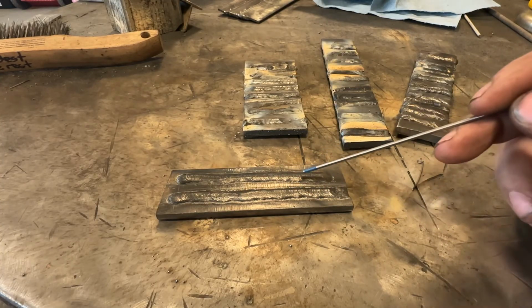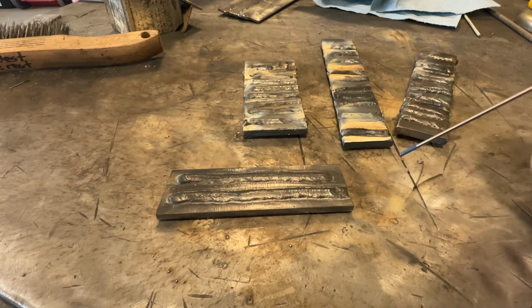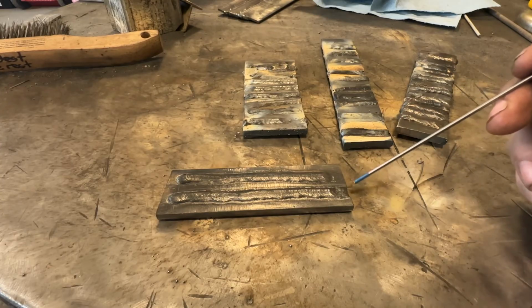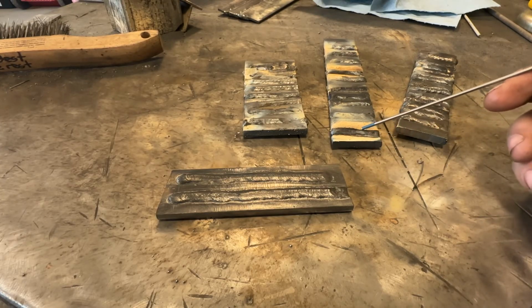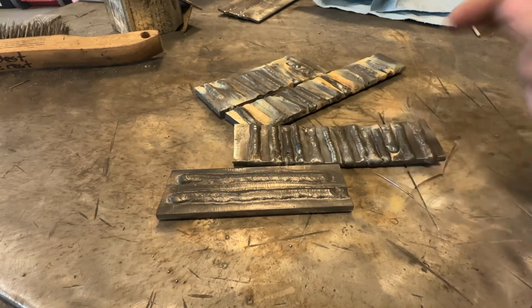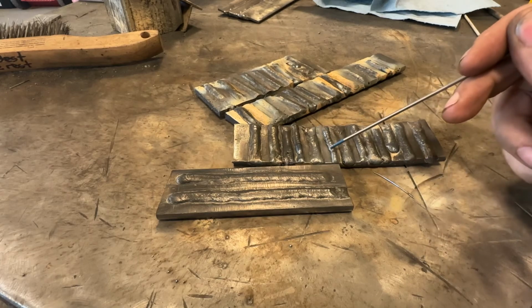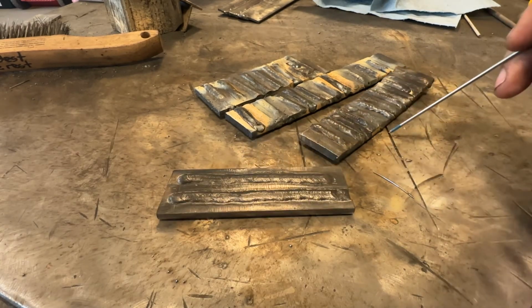And that's kind of the point of this video, is to show how important making little changes to make things better really is. And the first step to that is you have to recognize and ask yourself questions when you look at your welds. Is it cold? Is it hot? Cold here or hot here? What's going on? Is the weld the appropriate size?